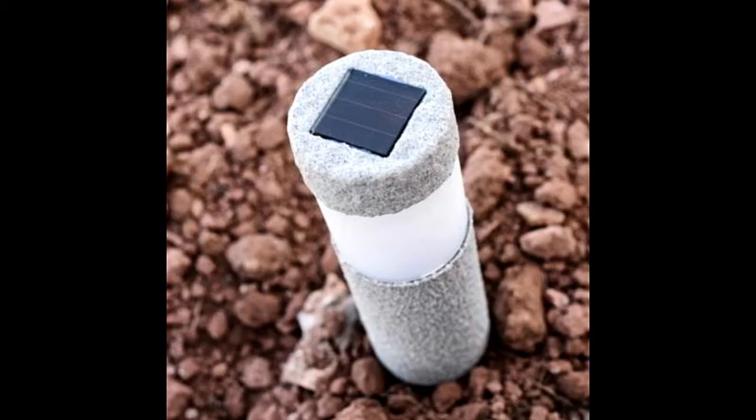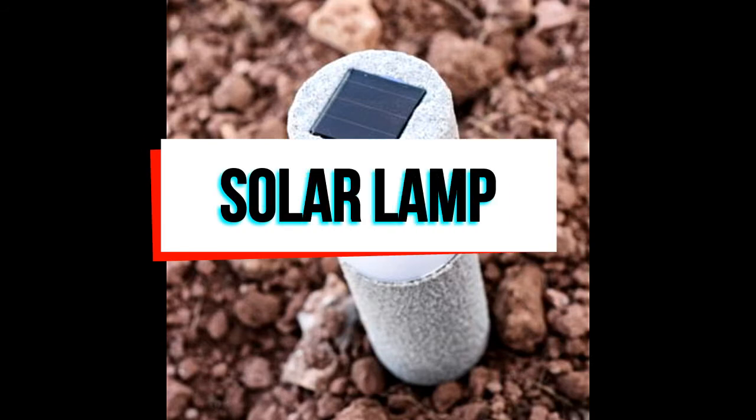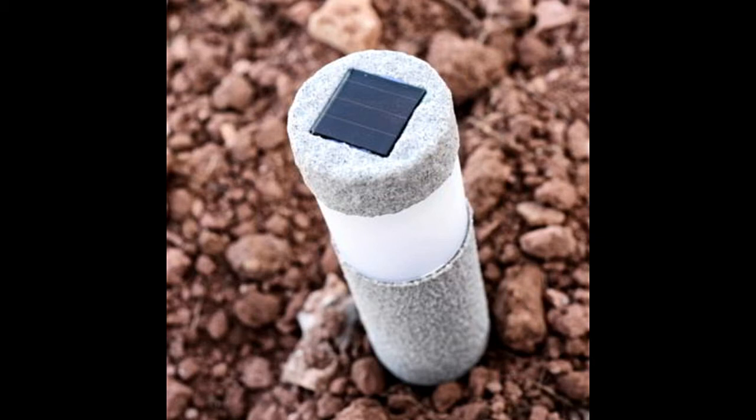Solar lamp working. Generating electricity. The first step to making the lamp glow is to generate electricity. That's the light cell's job. During the day, the sunlight hits the photovoltaic cell, which generates the electricity and stores it in the battery. Now, a single photovoltaic cell makes about 0.45 volts and a current according to its size. An ordinary solar lamp has 4 of these, which means you get around 1.8 volts that carries whatever current is produced throughout the day.